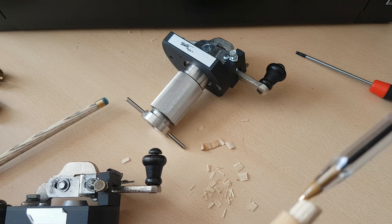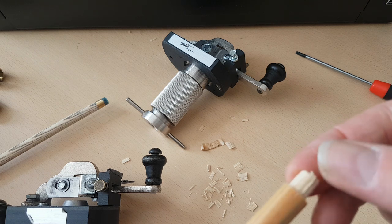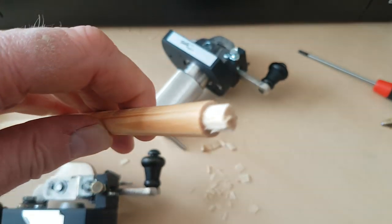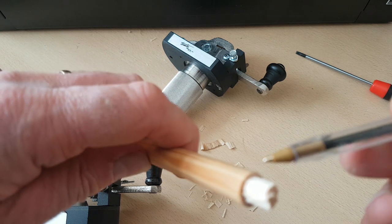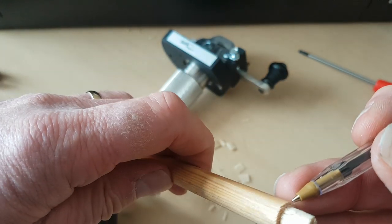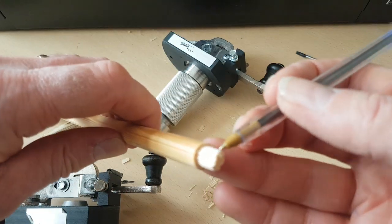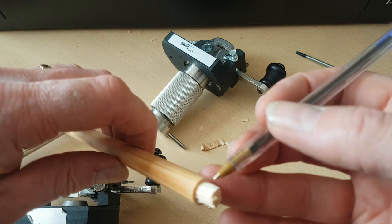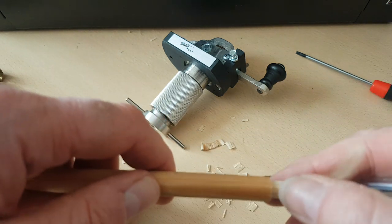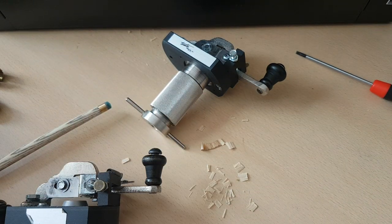Now, this isn't a very good bit of wood. If you get any splitting at all, that's why you want to practice. You should be able to see that the bottom cutter cuts a nice clean bit around the bottom there, and then enables it to cut the top one on the tenon without splitting. If it starts to split down the sides, then you really want that bottom blade adjusting. But that gives you a rough idea of what the tool does.